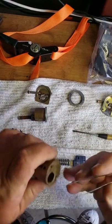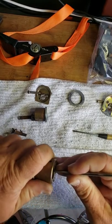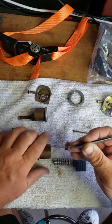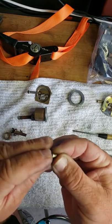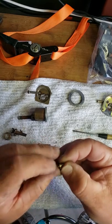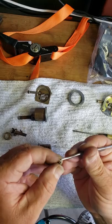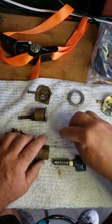We're going to pull a few of the pins out on top and check them. We have to be careful that they don't fly out because if they do you're going to have a real problem trying to find them. Here is a top pin of a MultiLock right there - it's spring loaded. You can see the spring loaded action right there. This pin is actually in good shape on this particular one. Obviously we have one that is sticking inside causing the key to jam up. This one is working okay, so that particular one is in good shape.